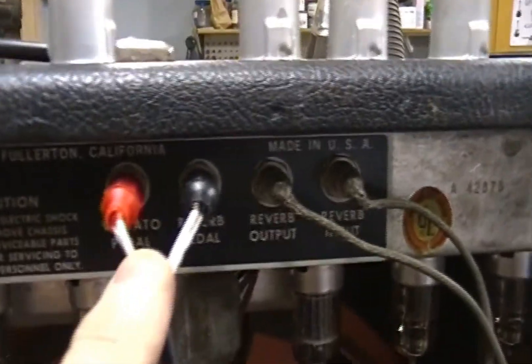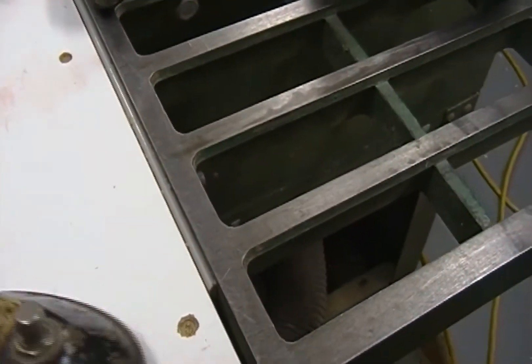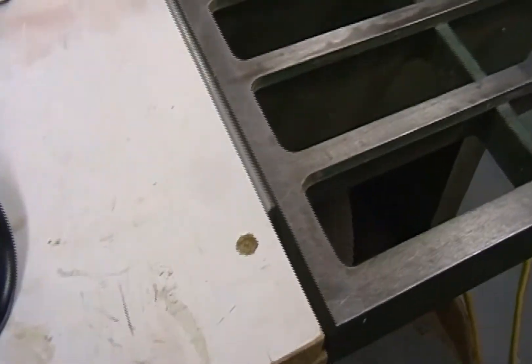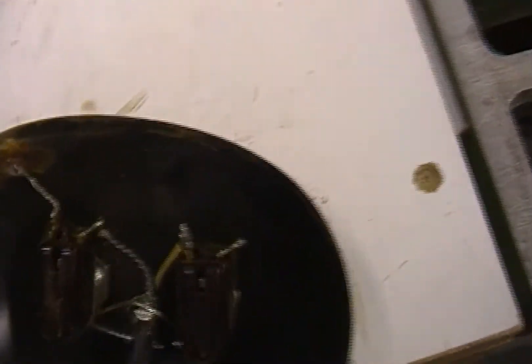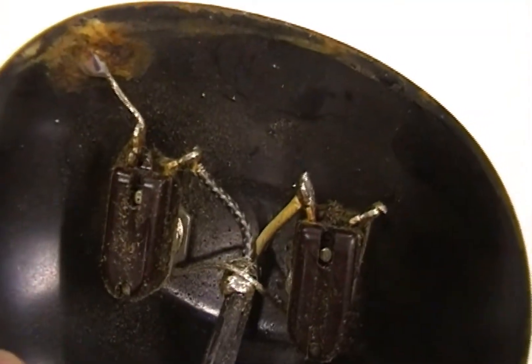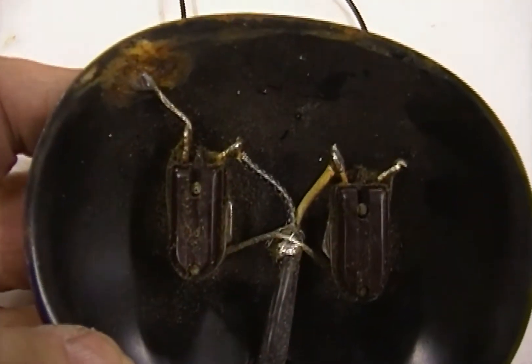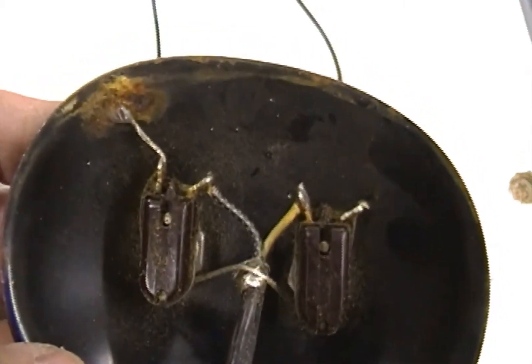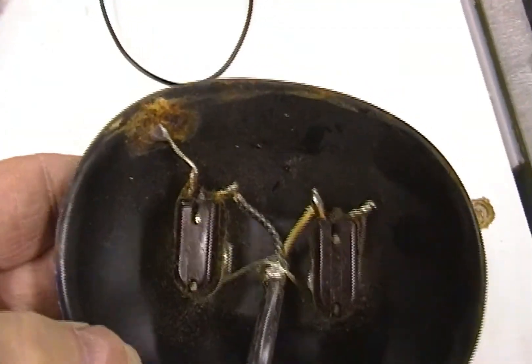I went ahead and replaced the ends on the pedal. We've got the old pedal here — one says vibe and one says reverb. You can stomp these all you want and nothing happens. I jumpered across the terminals on the switches with alligator clips and it doesn't change anything. The switch seems okay because it doesn't make any difference whether you push it with your foot or jump the terminals. So I'm guessing it must be a tube — if I'm wrong, please let me know.